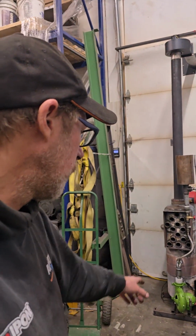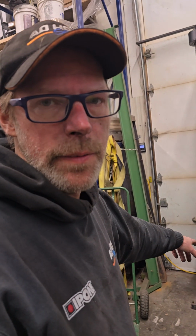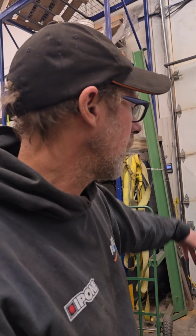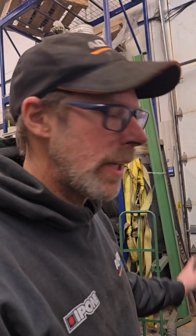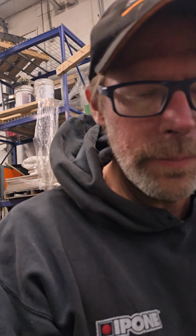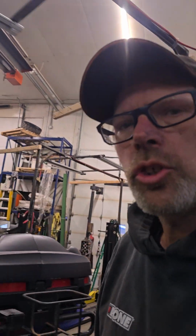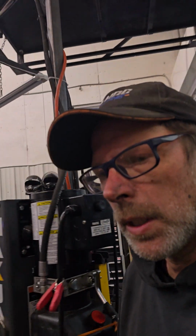And another thing, when we're using forced air, it creates a pressure, and when you start and it's cold, it's a pain in the ass to get it heated up. Everything wants to go out the door until it's hot. So with the fan forcing the air out, I think it's going to be the solution. So stay tuned, I'll try this. I'll probably set it up tonight. I think it's cold enough. I just shut down the burner. Probably cold enough, so I'm going to be able to get the elbow off and put the T.